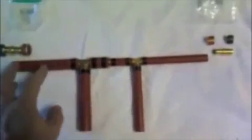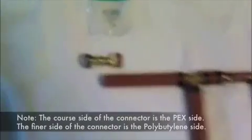The trick here is I've built up this piece and I've left these tails long on purpose. I'm going to cut my polybutylene at a certain spot, and then I'll cut this to fit. Just in case I have to trim my polybutylene back because I get a bad cut, I'll trim this one last. So I've left these long on purpose, and I'll put the fittings on after that.